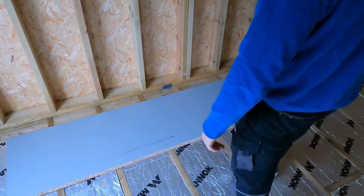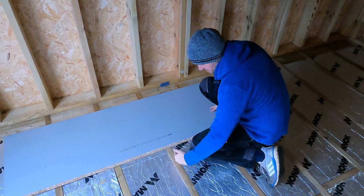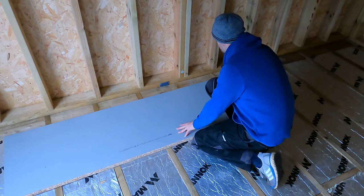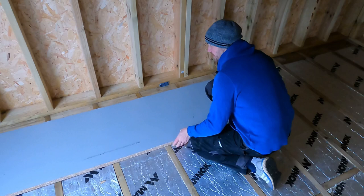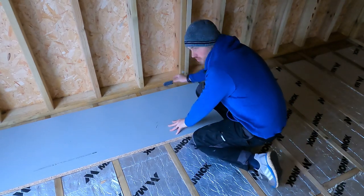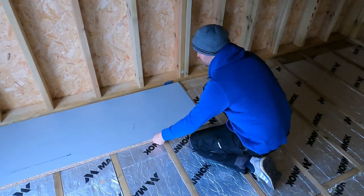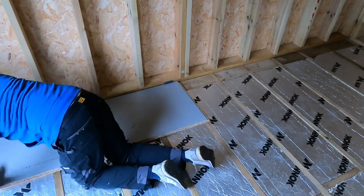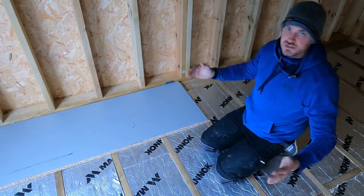So like I was saying, guys, 10mm perimeter. You put glue down, a nice 10mm bead across your joists, okay? And even on my perimeter noggins, that will all have some glue bond on there. And I'll put 10mm packers up against the sole plate of my walls, all the way around the perimeter where I'm putting the Cabershield floor, and just push them up until they touch. So it just needs to touch down there. And now you're ready to fix the floor off.